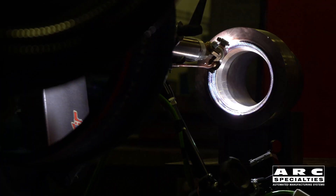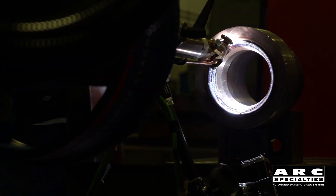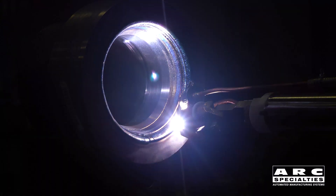Robots are gaining capability in replacing many of the older, less flexible welding systems. At the same time, we're going to be working on one of the most challenging materials: titanium. The problem with titanium — it welds easily, but it's easily oxidized.